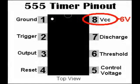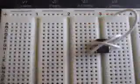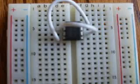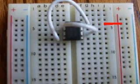If you are using the Learning Lab, 6 volts is available on top of the breadboard. In this picture of the breadboard on the Learning Lab, a white wire was used because it was the correct length to reach. Ideally, it might be a red wire for positive. If you are using a different style protoboard, your 6-volt power supply will be different. It will be connected to the power strips on the side, shown here as a red wire.